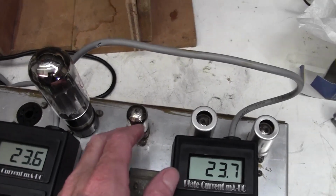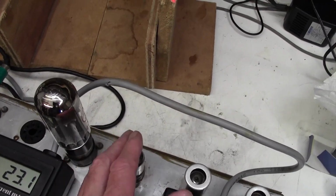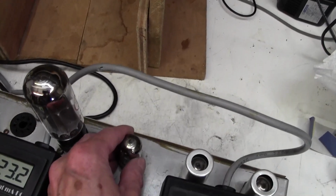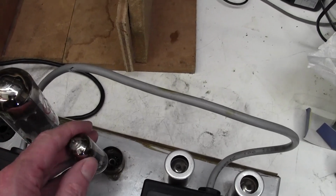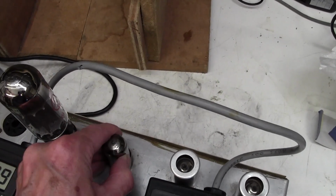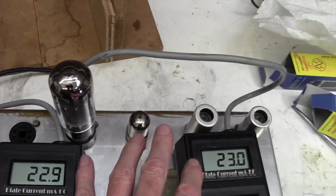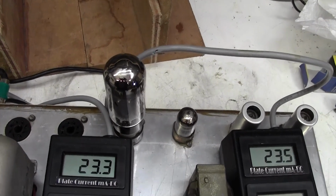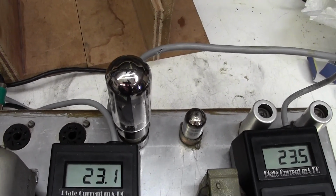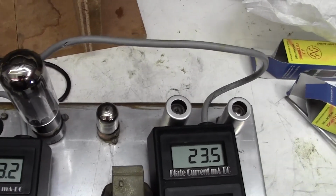Here's another little trick. We're just going to pull the phase splitter valve now, and that will isolate everything before the preamp side. Okay, that's interesting, so that does kill it. So it isn't just the power side. It's something on the preamp side. It might be that hideously large 32 plus 32 capacitor, or whatever it was there. Didn't like the look of that.